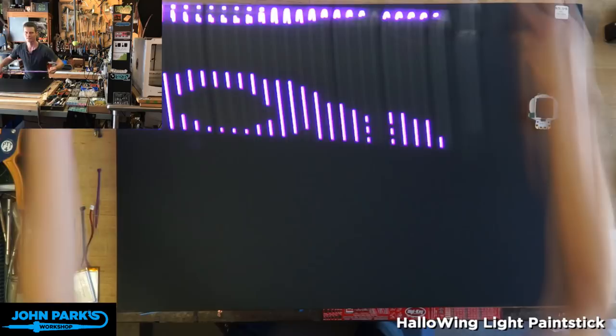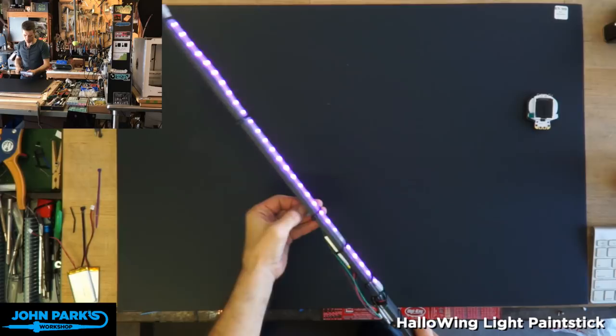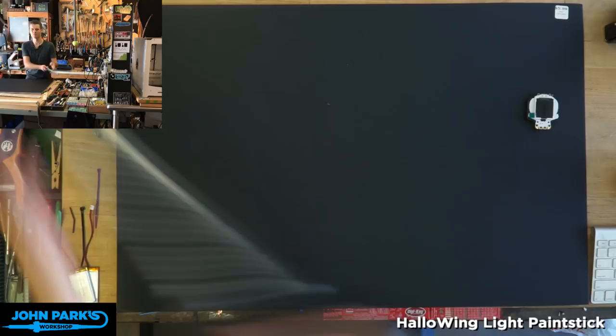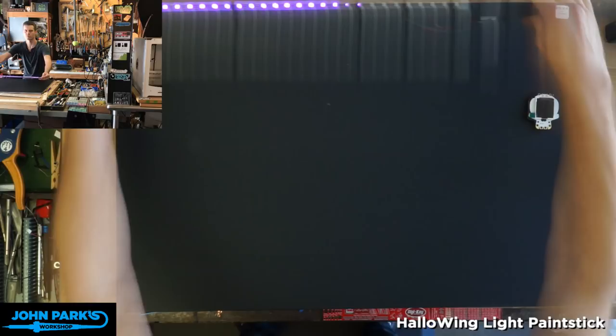And then if I change my, I'll show you here, it might be a little blurry. This is my little potentiometer, so I'm going to set this to be really slow. And now it should be a very wide skull, so we'll only get a little piece of him. So this is going to be a much bigger skull there. And if I compress this time frame down a lot, you'll get a very skinny skull, even though I'm moving the same speed.